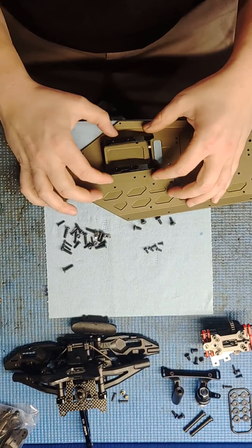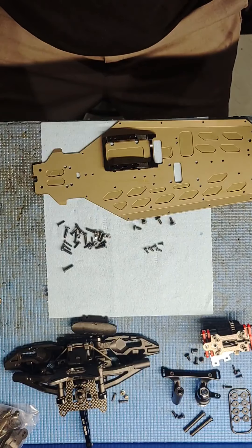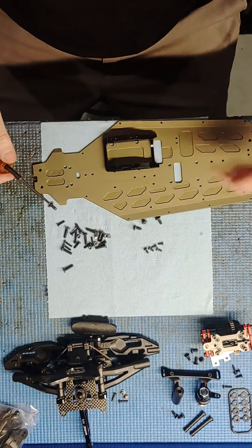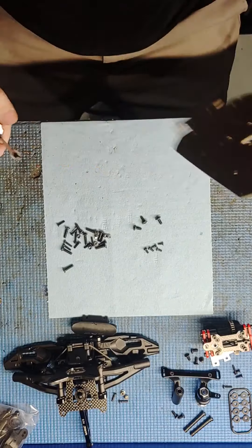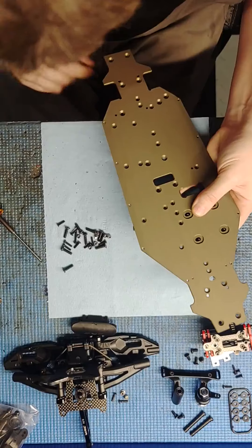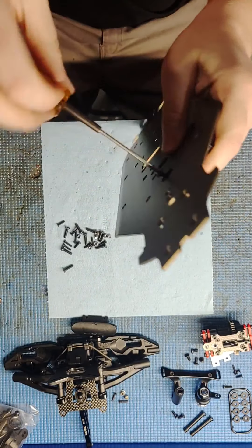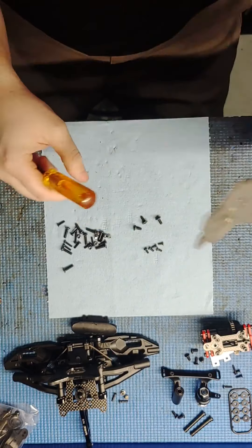I do run the one-piece motor mount. It's not a required thing, but I feel like it's a really good option. It stiffens the chassis all the way around the motor case, takes the flex out of the center of the chassis, and takes the flex out of your engine case — all good things. You don't want your engine case to crack due to excessive flex, and that is something that can happen. The engine case costs way more than this motor mount does.